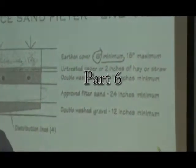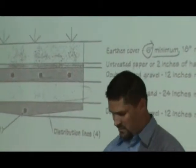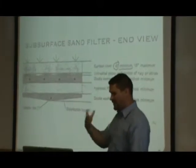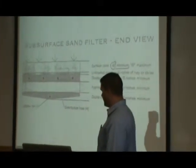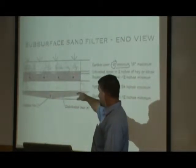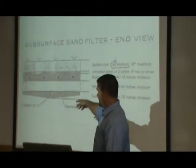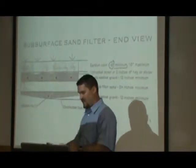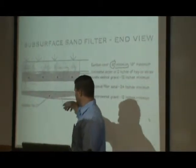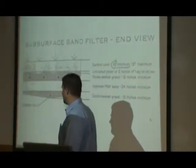We at least want you to try to find the location of discharge on page two. So if we have a discharging system, an aerator, a new APPS system, find that discharge on it. We want to make sure that it's actually clean and flowing. These things should discharge and we want to make sure that that pipe is clear. If it's down halfway down the hill and it may be 20 years later, been silted over, this may not have a discharge anymore, so it may be hard to find, but this should actually have a discharge line.